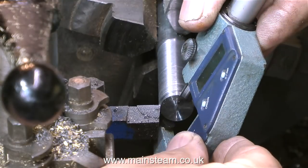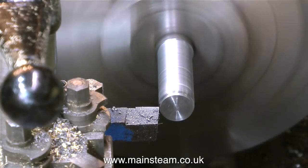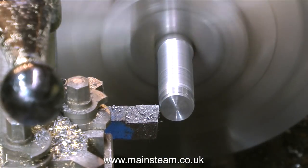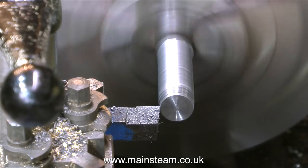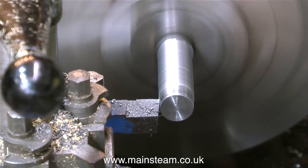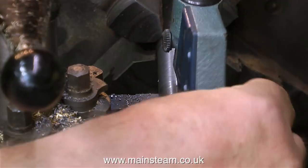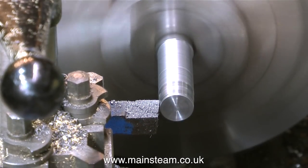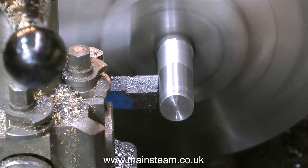Just in case you wonder what I'm doing on the lathe at the moment — I'm machining a plug gauge because very shortly I will be machining a flywheel, and the hole in the centre of the flywheel needs to be very accurate. I keep stopping the lathe and taking micrometer readings because I need to step this part, owing to the engine's crankshaft being very slightly tapered. It measures just a tiny bit less at the outer edge than it does nearer the main bearings.